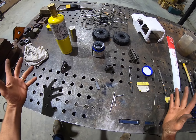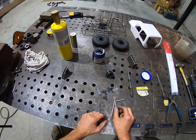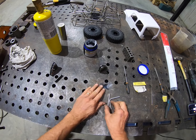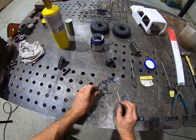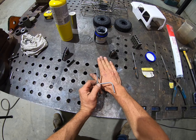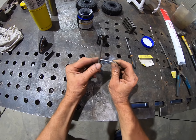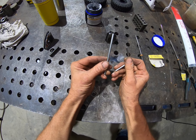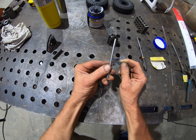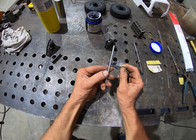There are many other products you can use - flux coated rods, for example - but I use this because I have great success with it, so I stick with it. Notching is one important thing to me along with a good silver content rod. Notching basically is getting rid of that gap - you've got a square edge on a round tube meeting up with another round tube, so there's a gap there.